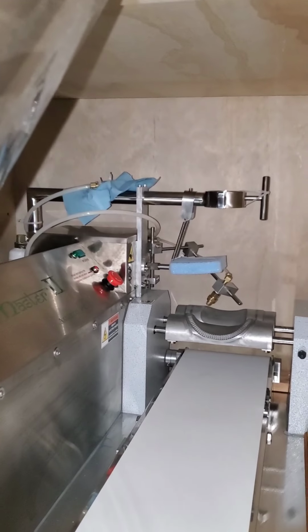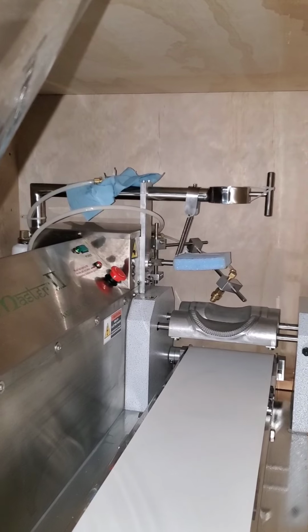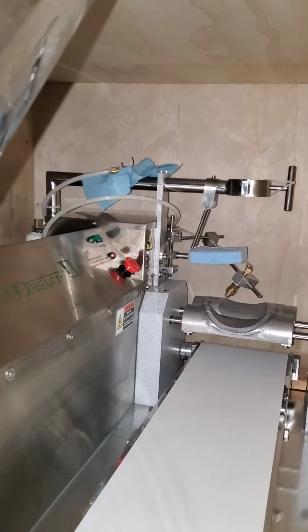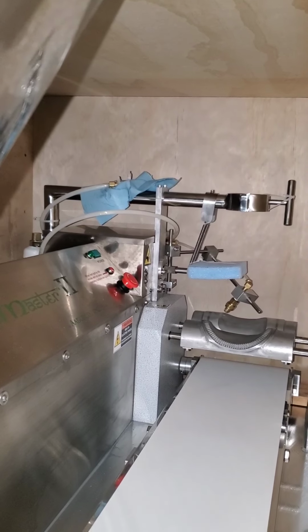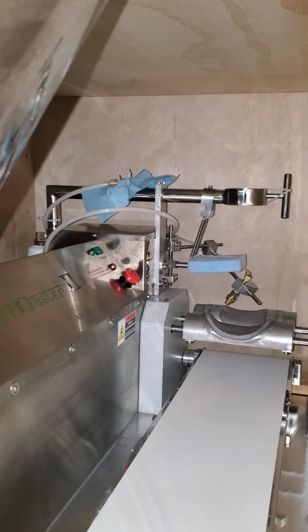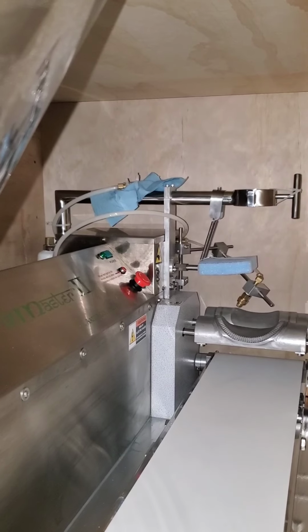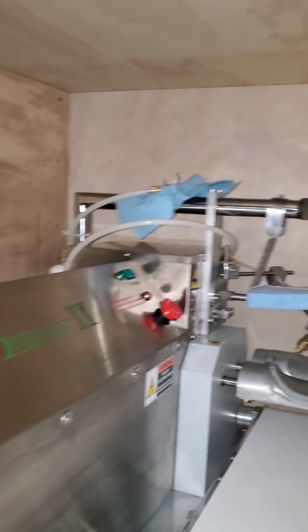And of course, when you're taking the whole machine out, once you free up the crate completely where the machine can come out, what do we always want to be aware of? The knife, the running chainsaw. It's got a foam cover over it for shipping there. You'll have a knife guard, the Delrin knife guard, to put on it during operation. But anyways, when you take it out of the crate, always be aware of that knife when you're looking for a grab point.